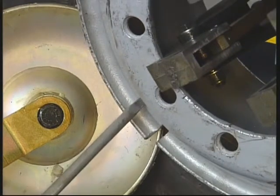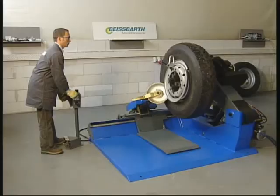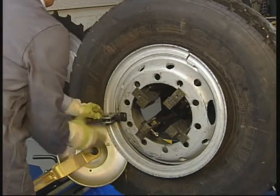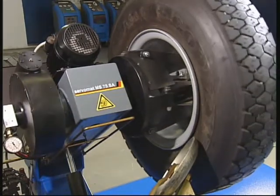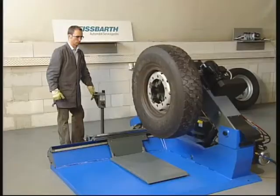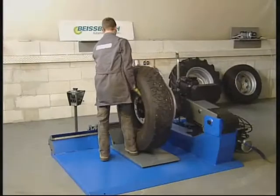Push the ring carefully with the tool arm from behind while pulling the locking ring with the lever over the flange. Now remove the ring slowly by rotating the wheel. Move the tool arm accordingly. Keep pressure on the ring as low as possible. Therefore, it might be necessary to turn the wheel back and forth sometimes. Now, break the rear bead and move the tool arm forward while turning the wheel until the tire comes off. Mind the valve. Push it into the rim in order to avoid damage.